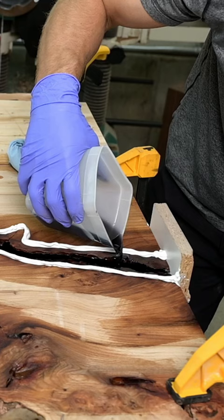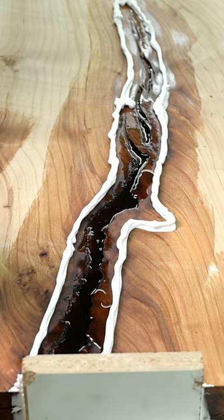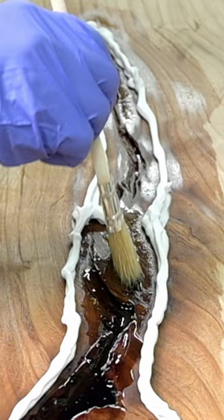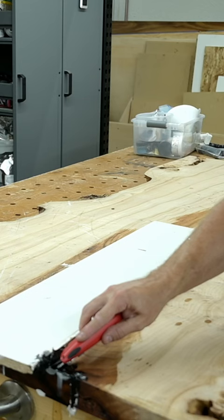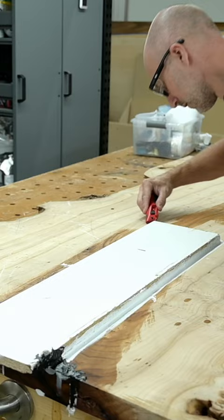So I used that piece of melamine, and I actually caulked it underneath, put one little cap piece, and then caulked all around both those. It's going to be messy, but it's going to hold, or at least I hope that it'll hold. That little dam is so I can overfill it and then surface it right back down so it's just level in the end, and I don't have to remove any more of the wood than possible.